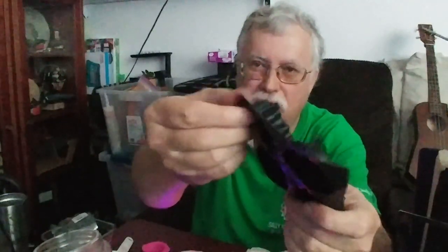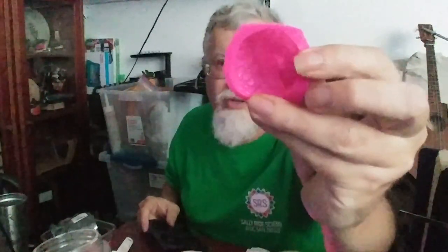How to make the molds: one way is to just not make the mold and buy them. Here are a couple of spider and web molds we got for Halloween. You want to get one that's pretty strong — some molds are for chocolate and those tend to be really thin, with no strength at all. When you try to push the thermoplastic in, it'll just deform the mold and you won't get a good result.